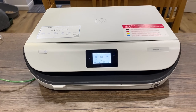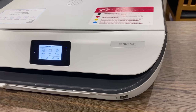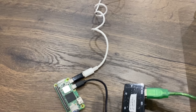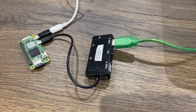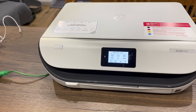Now unfortunately my printer doesn't have a USB connection — sometimes they have them to plug in a USB drive, which would probably power a Pi Zero 2W. As it happens, I'm just using the Raspberry Pi 4 charger to power it. And you can see I've just got a micro to USB-A adapter, which means the printer is now plugged into the Pi.